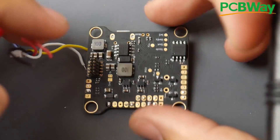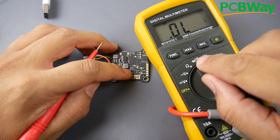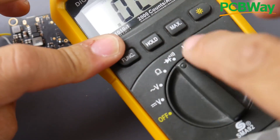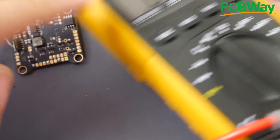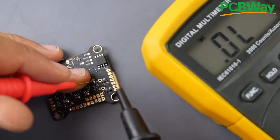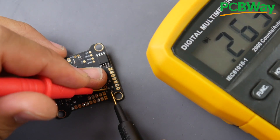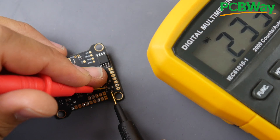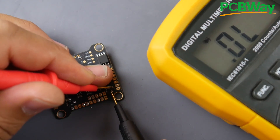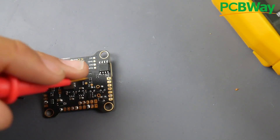Now the next step: set the multimeter into diode mode — that little diode symbol. Color matters here. Put the negative black probe on the top leg. On the regulator side we're getting a 2.34 voltage drop, which is a reading. But when we test the USB side — the side that's not working — we get nothing. That obviously means there's a problem. The connection on the USB side is gone or burnt from the short circuit I created.